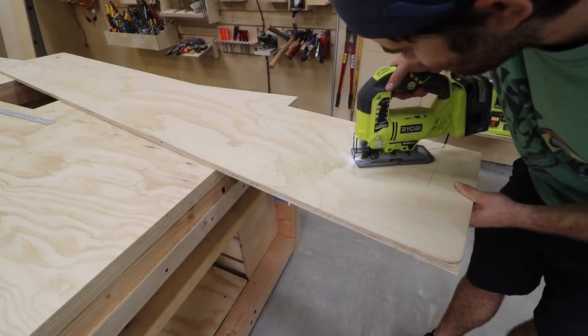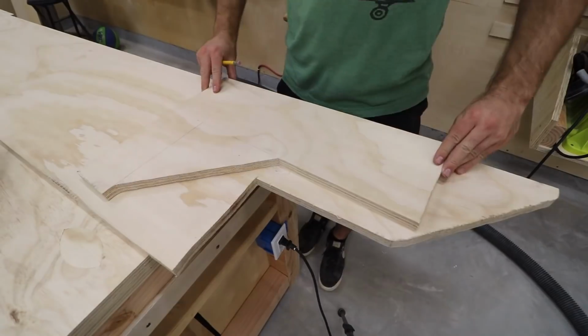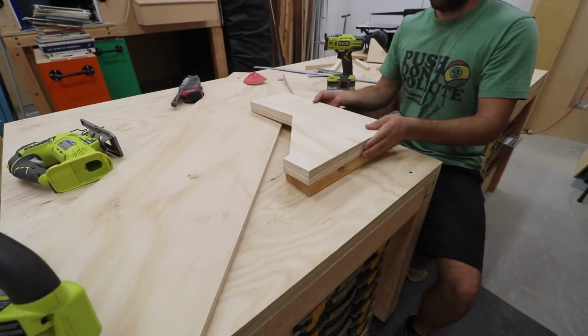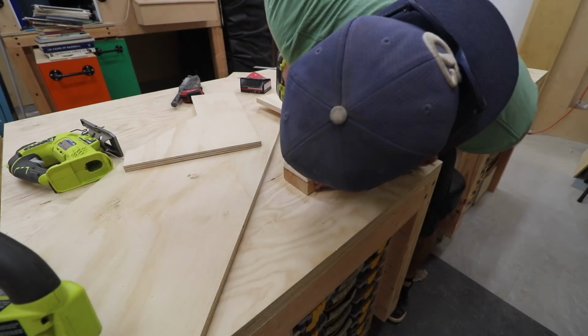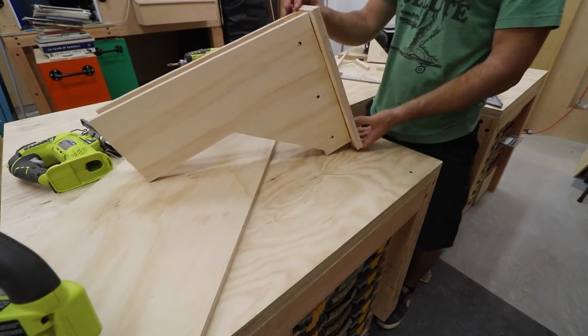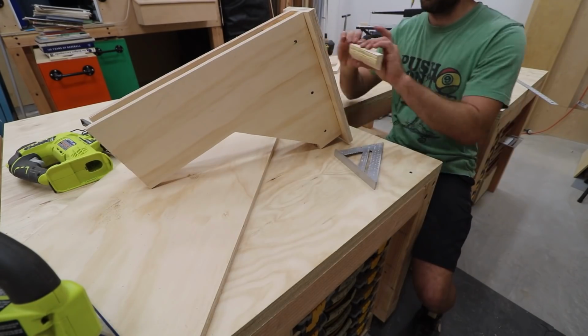The last clamp holder to build is for the bar clamps. I cut 2 identical pieces out of 3/4 inch plywood, then sandwiched those pieces around a 2x4. The 2x4 makes it a constant gap to hold the bar clamps, and the top part that contacts the clamps is at a slope downwards to the back.